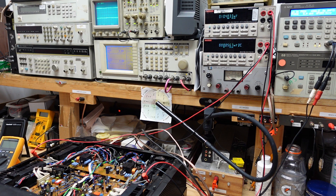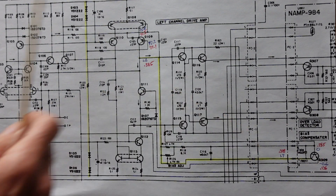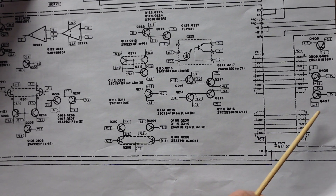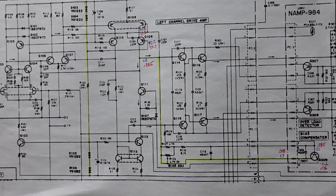I'm going to put a schematic up and show you what I found and what I believe the problem is. Full disclosure: I spent a lot of time on this. What Onkyo did was give us one channel fairly typical but they omitted the voltages inline — to find expected voltages we have to look at another part of the schematic showing transistors with expected voltages at emitter, base, collector, or source, drain, and gate. I took the voltages for the affected area and wrote expected voltages in blue and measured voltages in red. There's quite a bit of discrepancy, and highlighted here is the bias path.